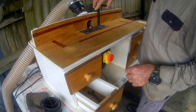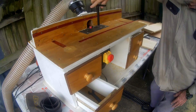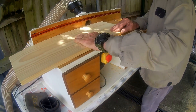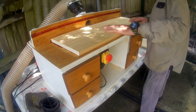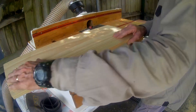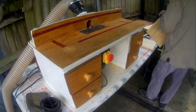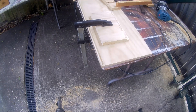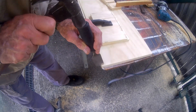I also used the bench router to reduce the width of the center shelf by 8mm to match the rebates of the edge boards. The rebates in the top and bottom shelves do not extend the full length of the boards, and I use a chisel to square up their ends so they can accommodate the backing board.